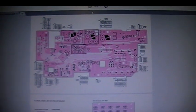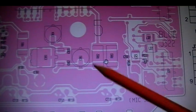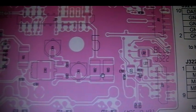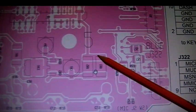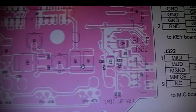The other connection we need is for the supply — the 14 volt supply. Again, if we're looking at that PCB, I've zoomed out so you know where I'm going. Going right down here, and there you'll see there's a regulator, but the part we're interested in is where these two resistors meet. Again, I'll put the information on a PDF in the description — that's R862 and R863. We need to solder across on that, just jump the power wire from there, which gives us 14 volt. So there are two connections: that's the supply, and the other connection is for the brightness adjustment.